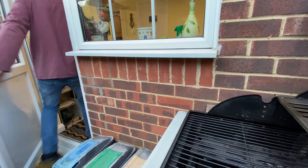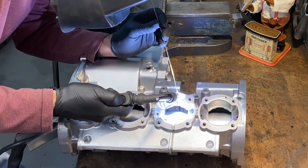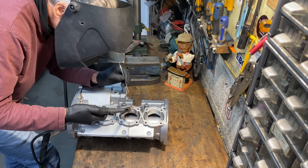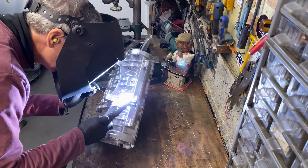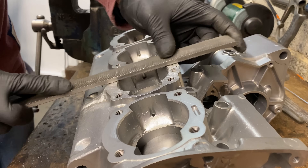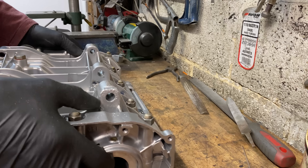I go back out to the barbecue to retrieve my crankcases and they are really hot — I can barely touch them, so I use a bit of cloth and get them straight into the garage onto the bench. I get straight on with the welding while the crankcases are really hot, which really helps with the welding process. I put several tack welds around the crankcase first before I do the proper welds — this helps to minimise distortion. With all the external welds complete I can now file down the welds that span the crankcase joint.